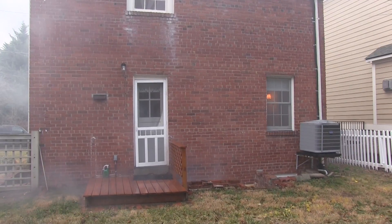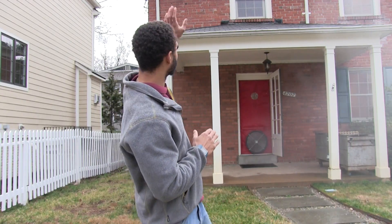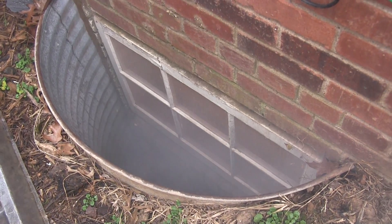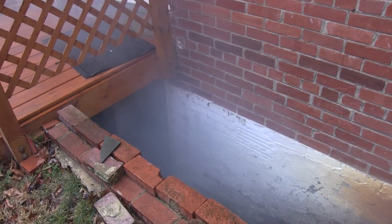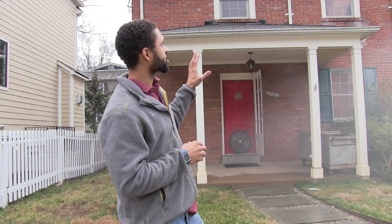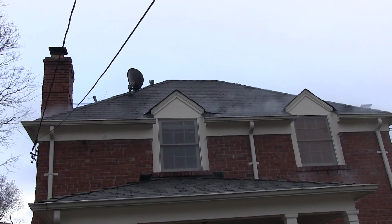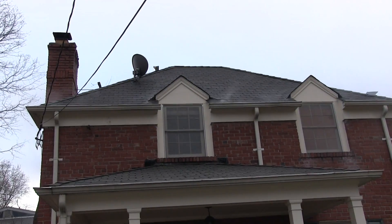What this shows me is that we have lots of places where we have leakage, particularly up in the attic where the eaves meet the house, and also around the windows — not so much the window panes themselves, but where the windows meet the jambs as well as the doors. What that air leakage in the attic is suggesting is that air is leaking through the second floor, up into the attic, and then getting out. One of the ways that we will remedy that is by making sure that we seal top plates and in-lights, and make sure we have increased insulation values around the perimeter.